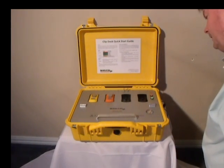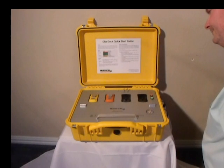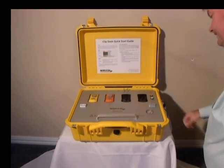The detector's alarms should sound and you should get a green light, or pass indicator, above each unit. If you get a red light during a bump test, which is the fail indicator, review the tips from this training video and bump test that detector again. If it continues to fail, contact us.